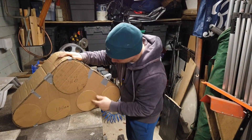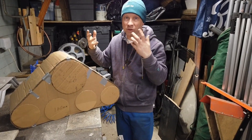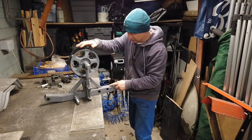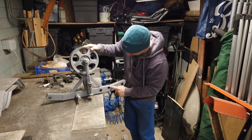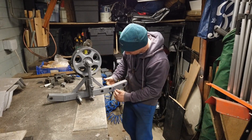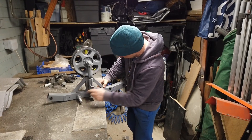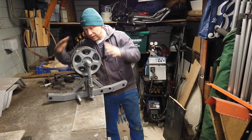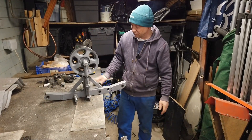So I'm going to drop a wheel — really, really simple. I'm going to raise that wheel off the ground and raise this wheel off the ground. It means it will pivot on that point, so when the tracks are on it, its contact patch with the ground is tiny. I've come back and modified it. I've re-drilled all this, which means once I've cut this off, my centre wheel will be on the ground and the outer wheels will be raised, creating a seesaw affair which means it'll go around corners. It's that simple.